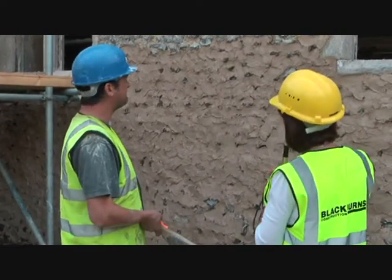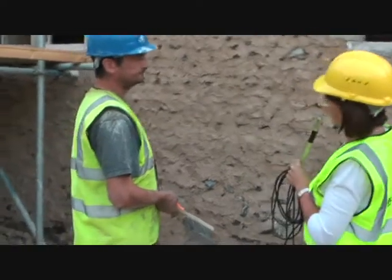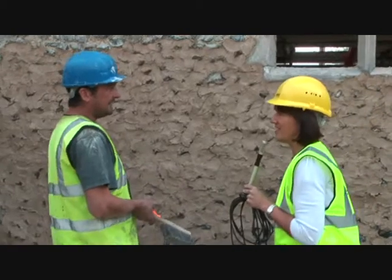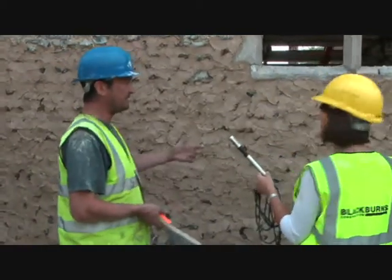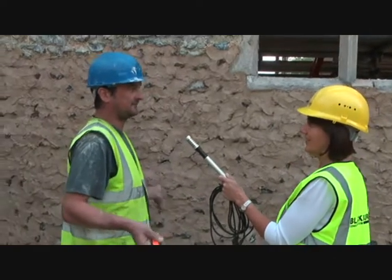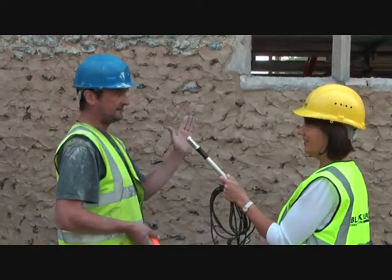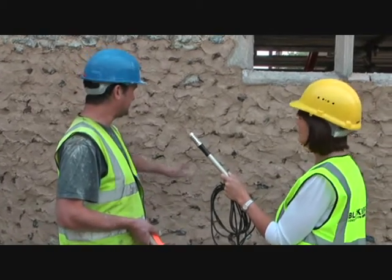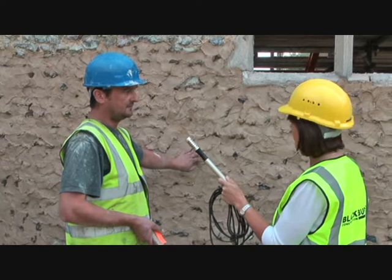And of course what this means eventually is that we have all the flints stabilised back in the wall, they're not going to drop off, and we've got rid of the horrible old concrete that was in there. With people and flint walls, if they are a bit wobbly, I've done an old outhouse for somebody and the wall's been going like that. But as soon as you point it up, it just stops the whole movement. But with this stuff, it gives you movement as well.